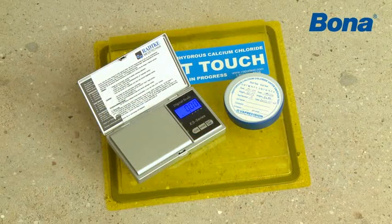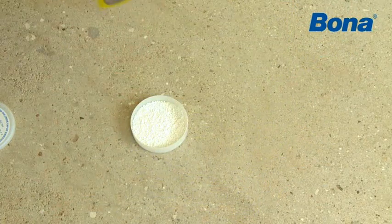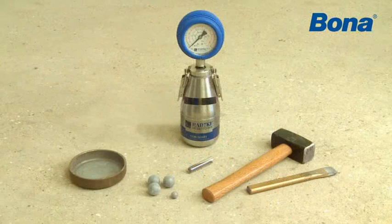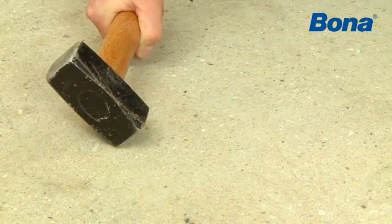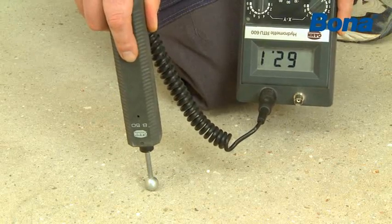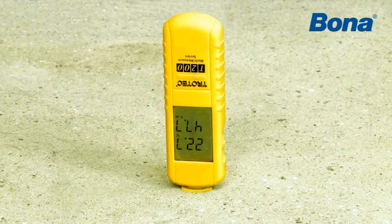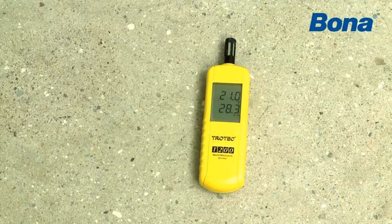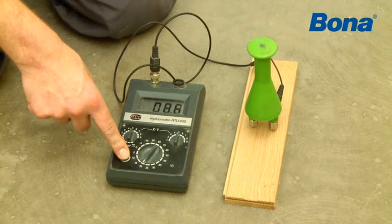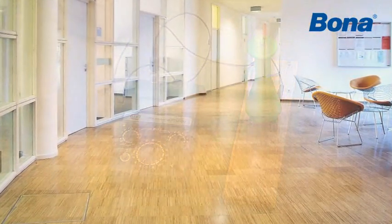The determination of moisture content is an essential part of quality control within the flooring installation process. Flooring installers need to know the dryness of not only the wood flooring, but also its subfloor and the concrete slab beneath it, if one exists. Handheld electrical tools, called moisture meters, should be part of the toolbox of every flooring contractor for measuring moisture in wooden or concrete subfloors and in the wood floor materials. It is equally important to check the percentage of relative humidity of the area of the floor installation as well as the storage space.